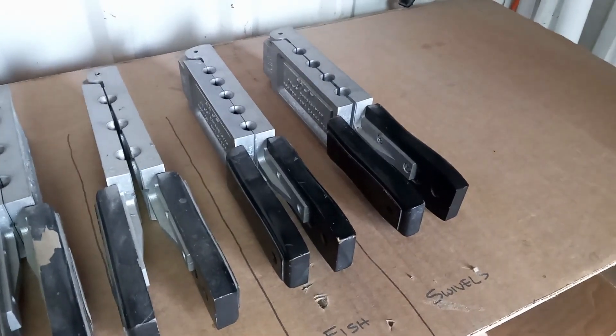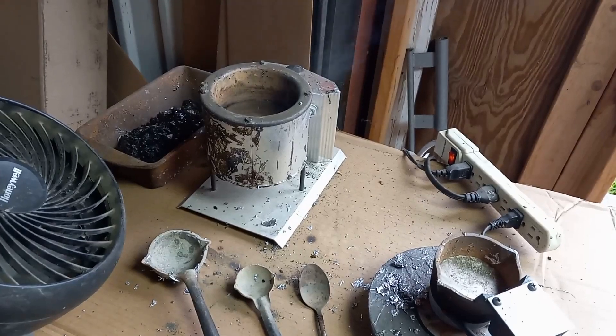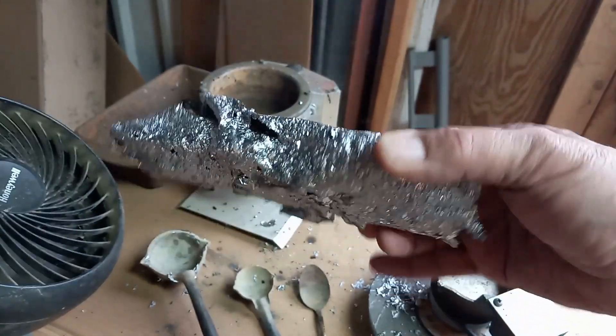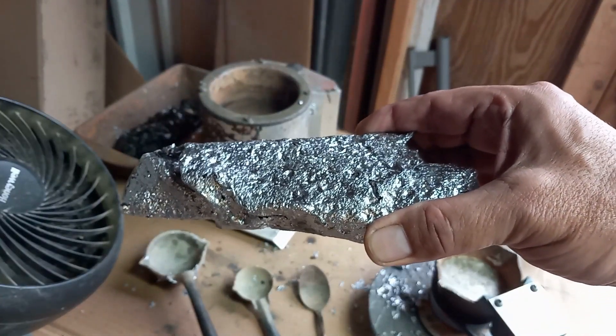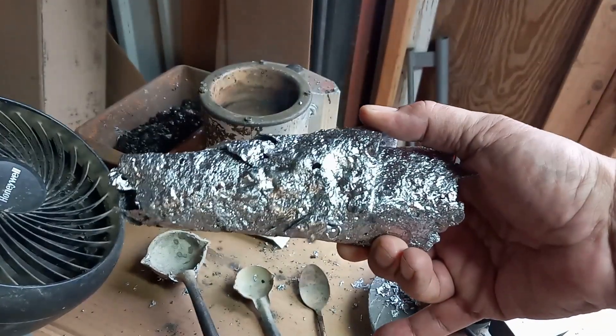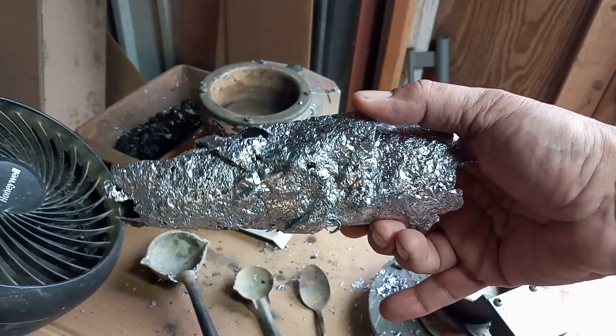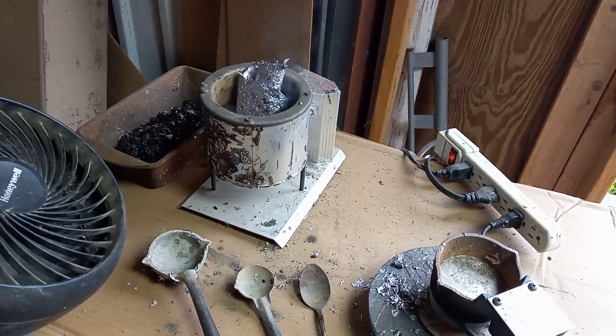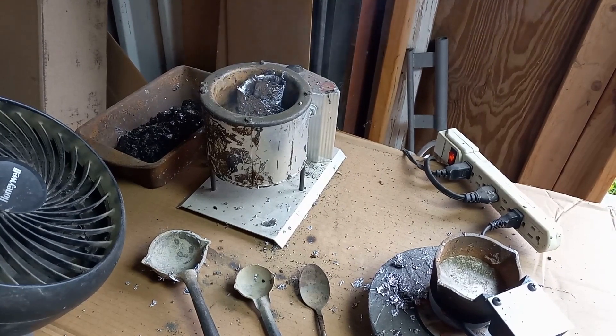In a previous video we showed you how to make what I call splatters, where we melted the lead on the pavement, rolled the thin sheets up into these cigar-shaped ingots. You just drop them into your hot pot and they melt quickly because they're thinner — not thick like a regular ingot — and they help you mass-produce when you want a quick result from melting lead.